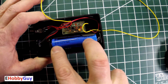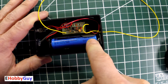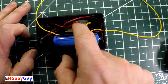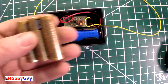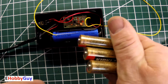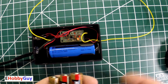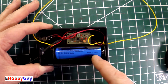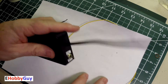I used a lithium-ion 18650 battery, which goes from 4.2 volts on a full charge down to 3 volts — which is the minimum the board needs anyway. But if you don't have one of those in a holder, you could use three triple-As, which gets you to 4.5 volts, or three double-As — they just about fit in the box. So there's an easier solution for those who don't have lithium-ion batteries lying around. Enough with the building — let's get to the fun stuff and start testing.